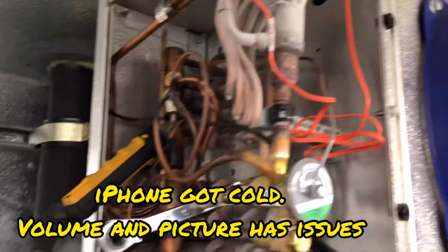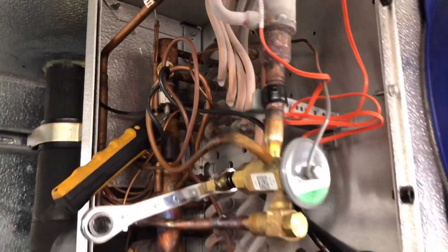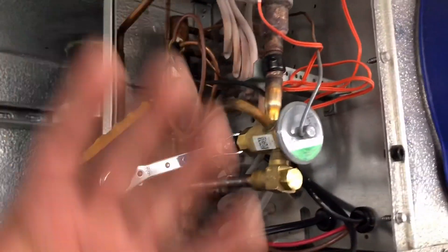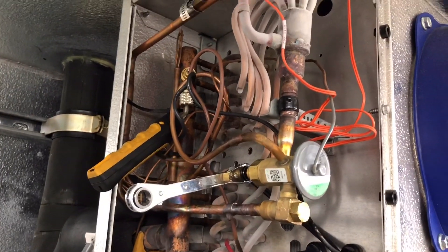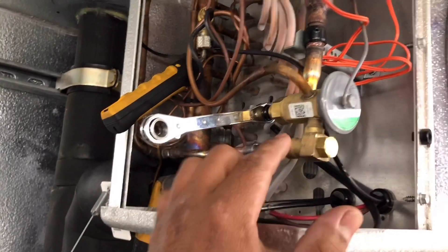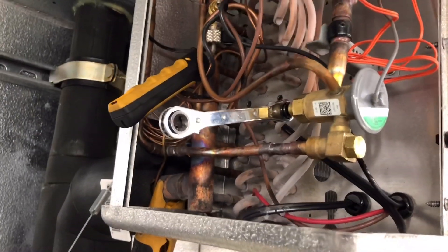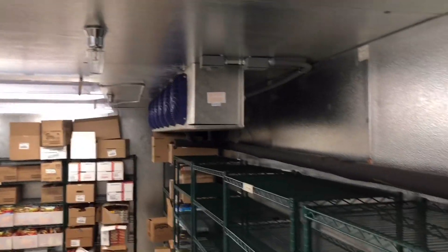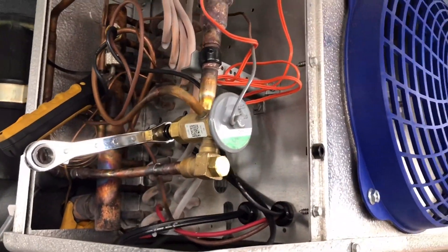This iPhone gets funky when it gets cold — everything looks fuzzy on my screen. So I had to go back up to the E2. I re-overrode the EPR — 30 was just a little too low, so we went to 50. We're checking evaporator number two right now. This one was at zero degrees superheat — it was flooding back. We're gonna give it a few minutes and see what we got, then re-verify that first one with a 50 override.